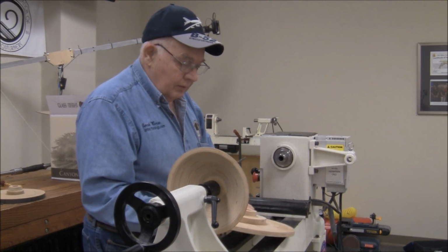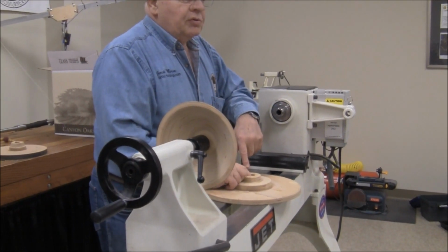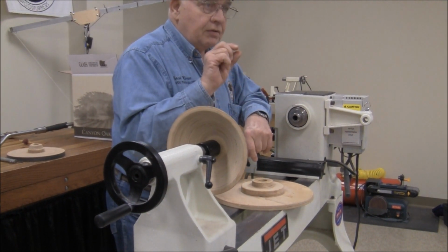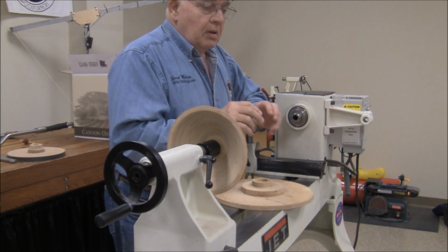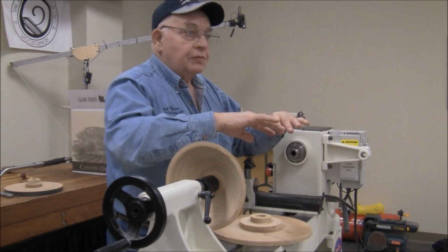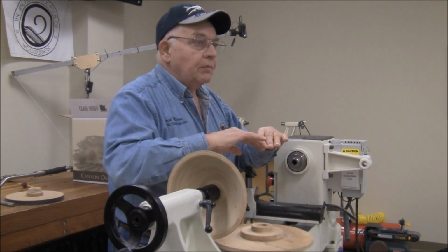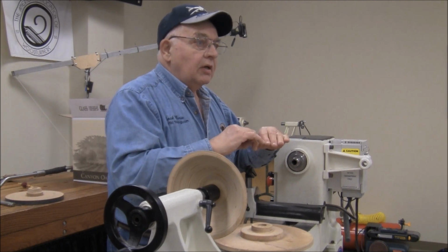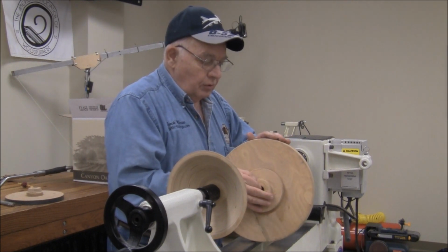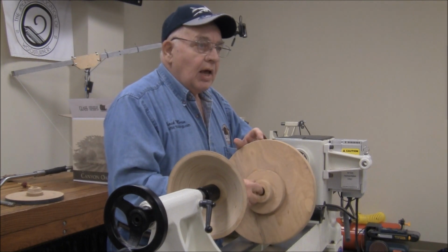But what I want to tell you about these pieces is they're made out of plywood. Don't use anything but Baltic birch plywood. If you use plywood that's got the thicker veneers, when they cut that off thicker, off a round cylinder and then flatten it, it's just full of cracks and voids. They don't put enough glue to fill up those voids, and when you start cutting into that void, it will separate and fail on you. So don't use anything except this Baltic birch plywood that's got 1/16-inch plies.